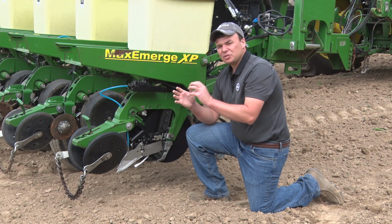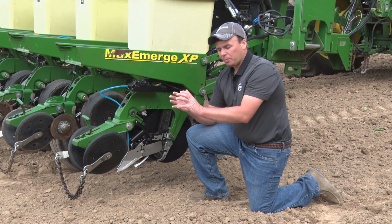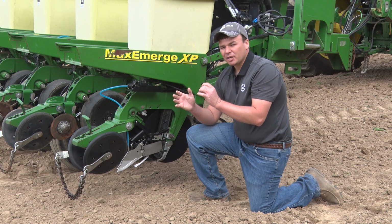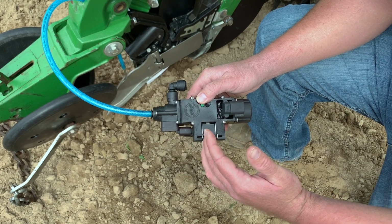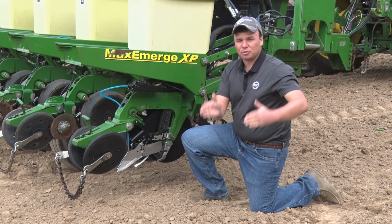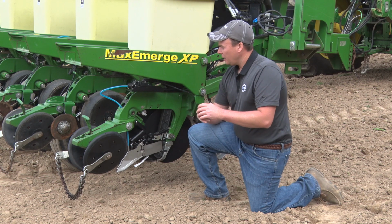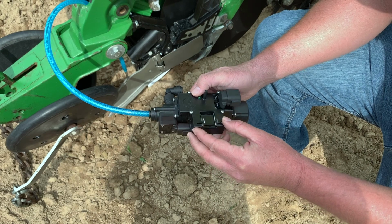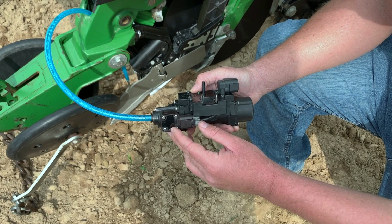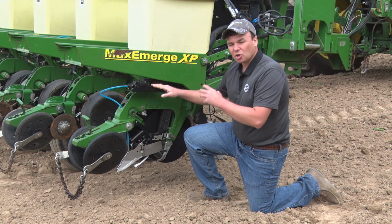We're able to control that position of the plunger, and as we open it more, we get more flow, and as we open it less, obviously we get less flow. And we can move that plunger very, very quickly, in just a millisecond or two. So we can pull that plunger open, create a shot, slam it shut, and that creates our unique and consistent Dash shot that goes over the top or near each seed. So we're opening and closing the plunger very quickly. Then as that flow is continuing through, we measure the pressure on the outlet side. It gives us a good idea of how crisp the shot is and making sure the valve itself is performing the way it should.